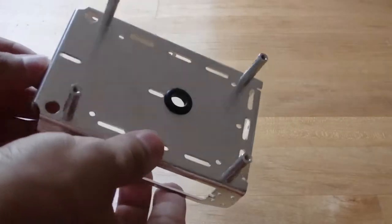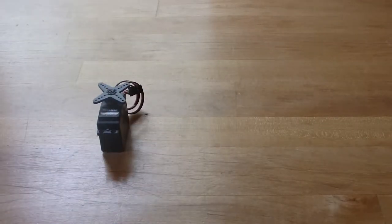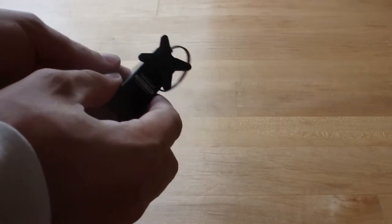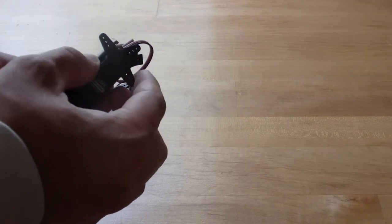Here's what the chassis should look like with the grommet and the four standoffs applied. Next up we need to prepare our servo motors. Sometimes commercial off-the-shelf components don't come exactly how you want them. In this case we have control horns on the servos that we need to remove.